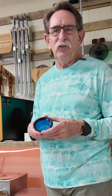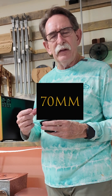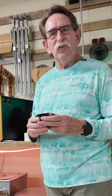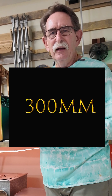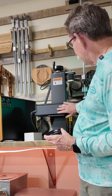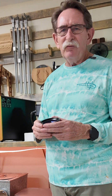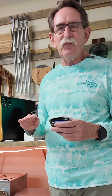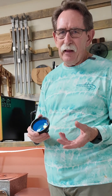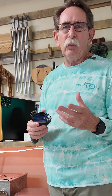First, can you get additional lenses and why would you need one? The one I'm holding right here is a 70 millimeter lens, meaning that if you're going to engrave something that is 70 millimeters by 70 millimeters, this is the optimal lens. The lenses go up to about 300 millimeters. The distance from the lens to the material has to be adjusted, which is why, like on this Haotian laser right here, it has an adjustable tower. Some of the machines out there have one fixed focal distance — I saw one yesterday where you had to slide the material in underneath a certain guardrail. Can you even get another lens for it? Is the bed large enough to do what you want to do? These are just the questions you'd want to ask.